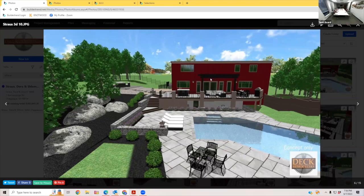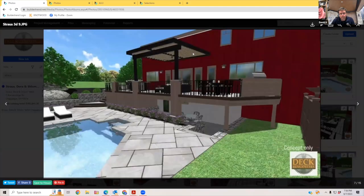Does the 4x8 return back to the house? On the sides, yeah. If you look at it from here, there's a drop. And then these beams return back to that. No, I'm talking about the one below that. That face, that's the main girder. No, this is just a drop support. But is that 4x8? Yes. And how far back is that from the front? This is a 2-foot cantilever. I think the drawing's just bad.